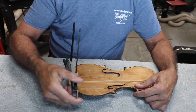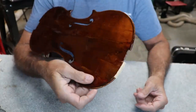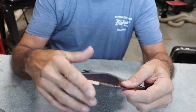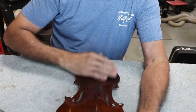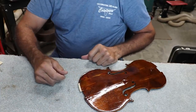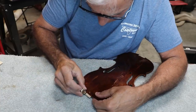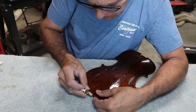Due to things that happened, old Chocolate's been sitting for several more days. It's not real impressive at the moment, but that is on there good and solid — it will not be coming off. If you'd just glued this onto the butt end it would have gotten knocked off in no time, but now I can round this off and match the rest of the instrument. I'll have to stain it and put the oil varnish over it. I'm going to start with my little finger plane — I have the tooth blade in here because it will cut across the grain.